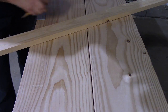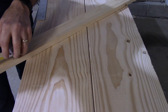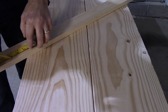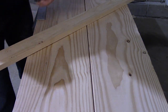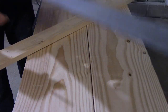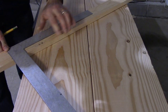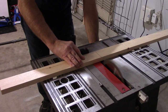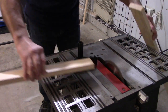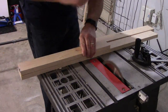Now we measure where we're going to lay our support pieces across the top to join the two pieces of wood together. We have two-by-tens here, but two-by-tens are not actually ten inches wide — they're about nine inches wide — so make sure you measure it and lay it out so you know the exact length of wood you need. Once we mark it, we'll cut it with the saw. We're going to do the exact same thing for the other two supports.